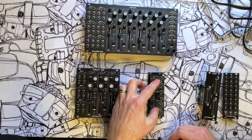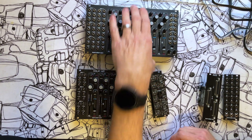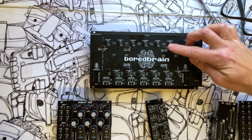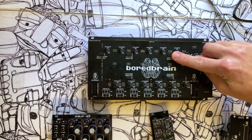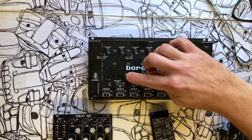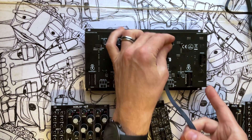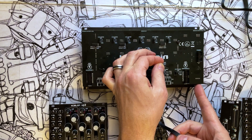On the back, these two connectors each carry six signals, or three stereo channels. On the back of the Exelon mixer, you have the same type of connectors. You have pre-fader output for channels one through three and post-fader output for channels one through three, and then the same pre and post for four through six. So you get to choose how you want to connect it - if you want the pre-fader direct out, you connect to these connectors; if you want the post-fader, you connect to these.